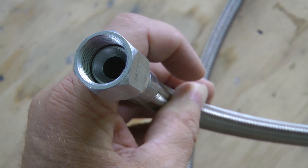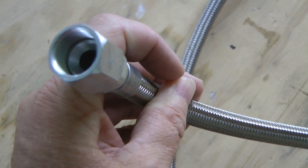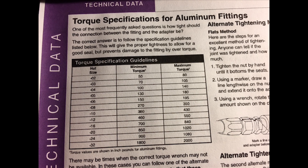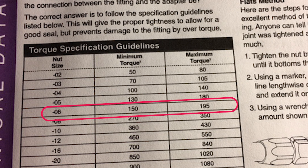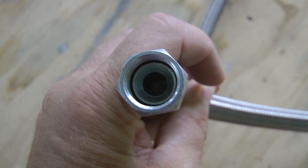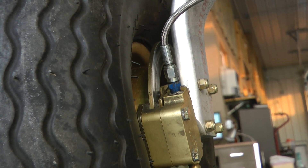What if your flare connection is not tubing at all, but rather a flex hose? The material used in these hoses is generally harder than the tubing we've been discussing, so we need to check with the manufacturer. For example, Aeroquip provides a chart: a dash-6 hose connection needs a torque range of 150 to 195 inch-pounds. Note that these values are much higher than those for soft aluminum tubing, because the aluminum alloy of the internal flared flange is much harder and needs more force to compress it for a leak-free seal.